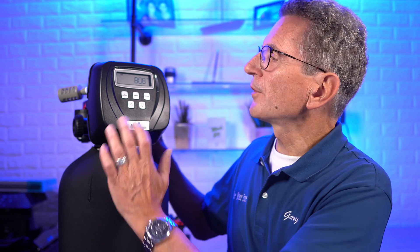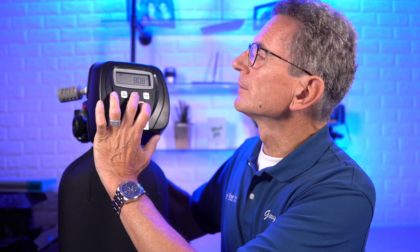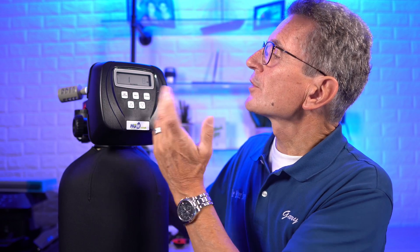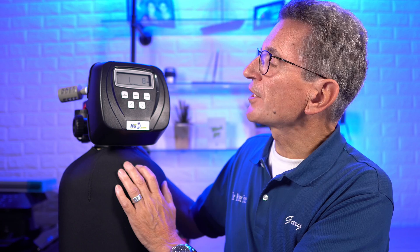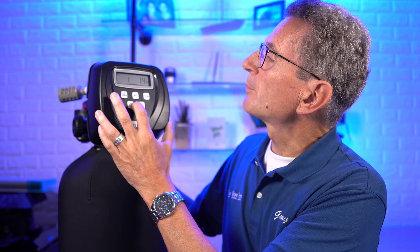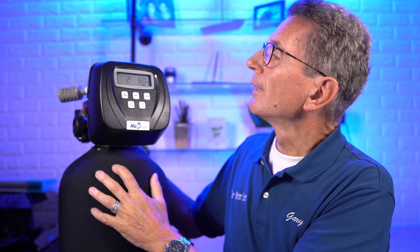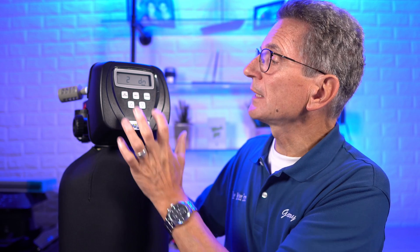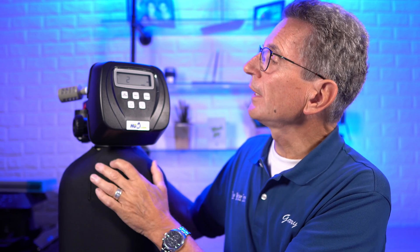Next we want to go into system setup — press next and down together, hold down until the screen changes. It's showing 'filtering' up here, so that's correct. Press next. This is the first cycle — for an air over media iron and sulfur filter the default is 15 minutes. It's currently flashing 8, so press the up arrow to get to 15, then press next. For the air draw, it shows 'down brine' — the correct terminology. We want to change this to 30 minutes; it's currently set for 60, so press the down arrow to 30, then press next. 'Off' — those are just the two cycles and it won't go through any other cycles.